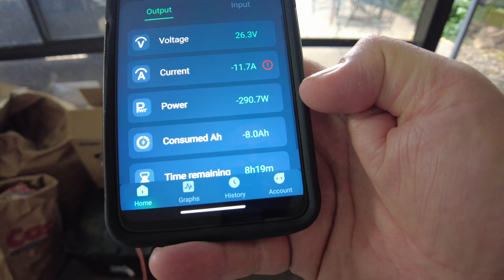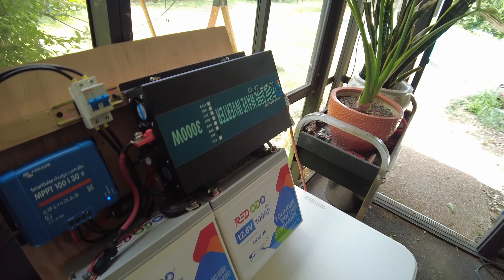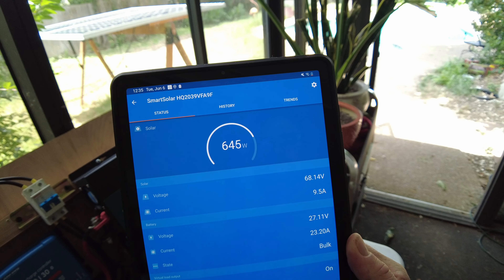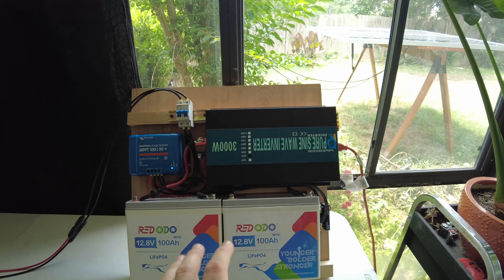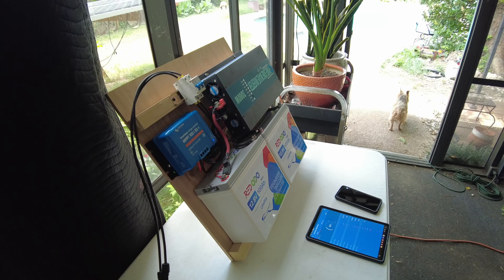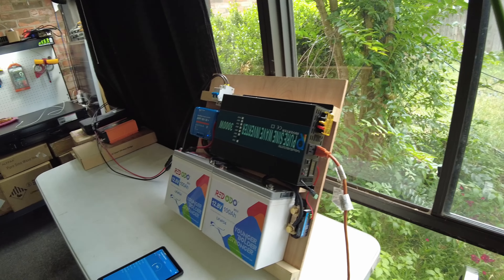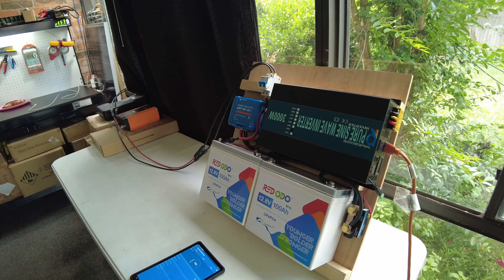Turning the solar back on we're getting 180 watts, climbing over 500, then 660-665 watts as the cloud clears. In theory this charge controller should get us about 840 watts in this 24-volt system. Look how small the profile of this system is — you could literally hang this board on a wall, or put the whole thing in a van, RV, or use it for backup power. I hope you enjoyed it — links to all products are in the description. Please hit like and subscribe, and I'll catch you on the next one.